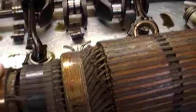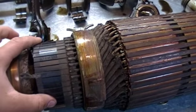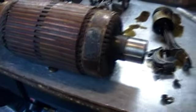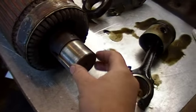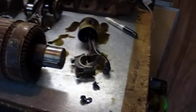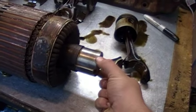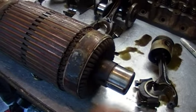I need to clean the commutator up — it has both DC output and AC. I weighed this rotor at the scale at work: it weighs 75 pounds. It has a two inch diameter shaft which couples to the engine shaft via a large coupling that also serves as a flywheel and a cooling fan — a big cast iron thing. I believe the shaft on the engine is one and a half inch diameter.